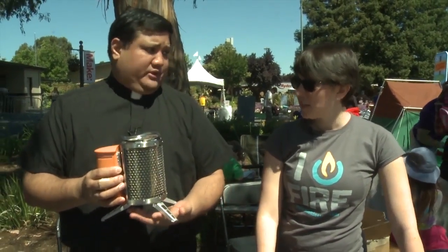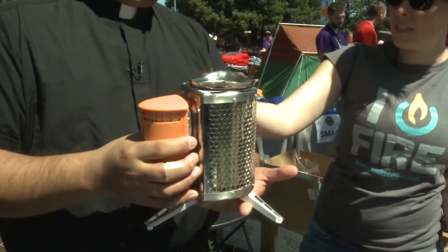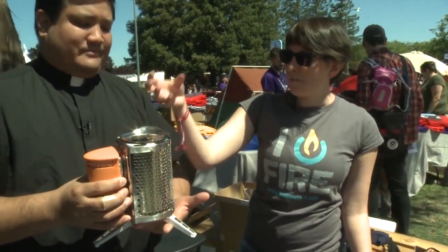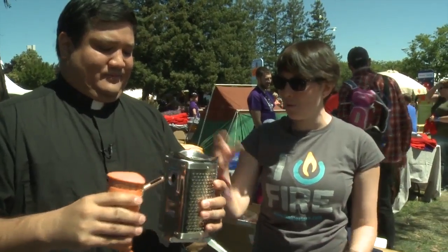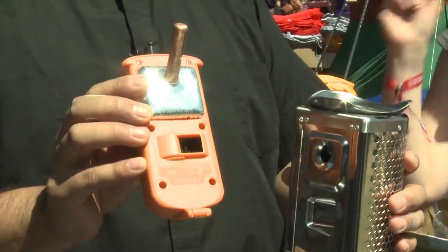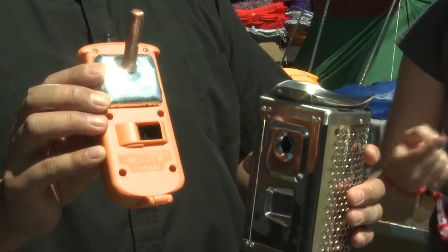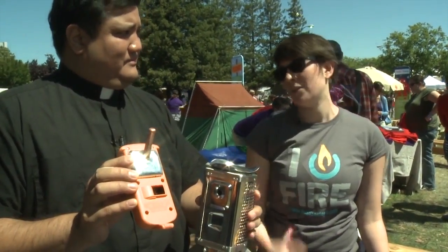You told me there's a really cool feature here about how it cools down the unit at the end of your burn. How does that work? So yeah, exactly. We've designed this to be as fun, but also as safe and efficient of an experience as possible. So we've got some smart logic built into the power module where it will sense the core temperature of the burn chamber. So if it's too hot, that fan is not gonna turn off. So let's say that you're feeling a little impatient, you're like, oh, I'm done with this, and you turn the fan off and walk away. That smart logic is gonna say, no, it's still too hot, and it's gonna turn itself back on, and that fan's gonna burn all of the embers and all of the small flames down to complete cold ash, and then that's when it'll turn itself off.